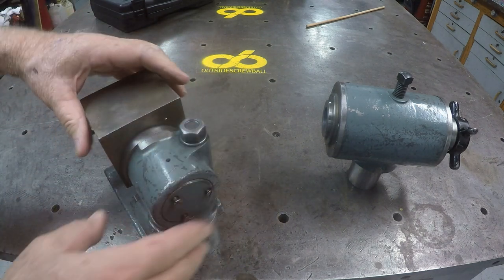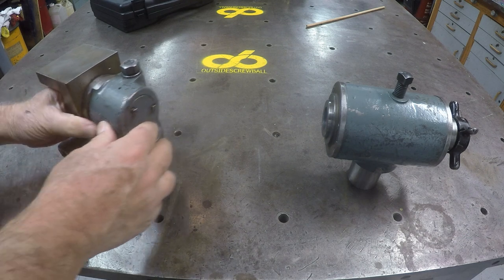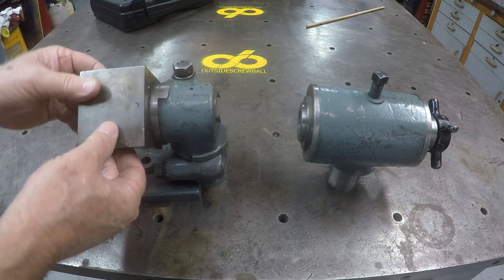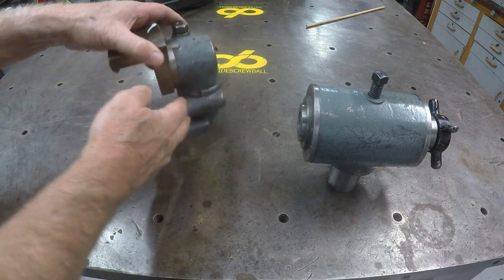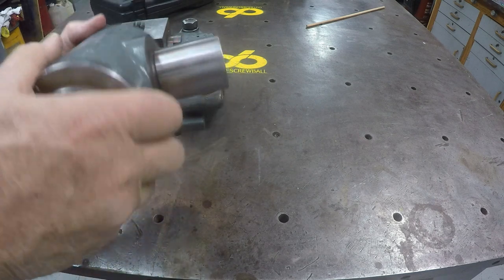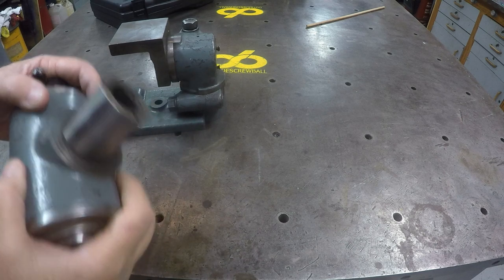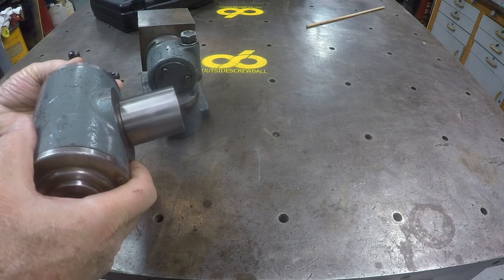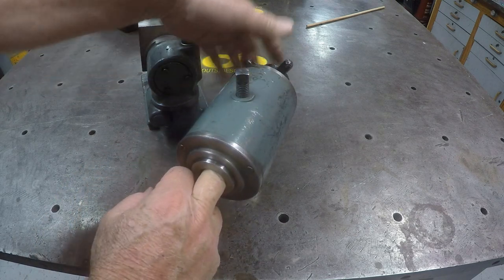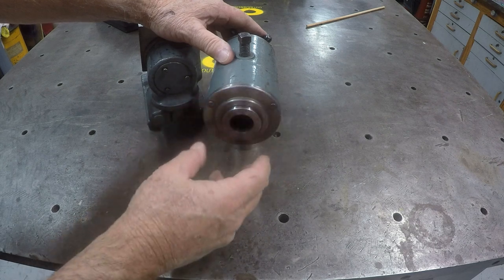It's got a degreed head here which rotates, and then there's a degreed head here that rotates. Somebody made this plate in here nicely, and I thought this would work great on the grinder — you can set up an angle and use it. The other part of this tooling has a taper, and I wanted to make an insert for this with a drawbar out the back and maybe put an ER setup on the front. I could put a small chuck on it — lots of different things.